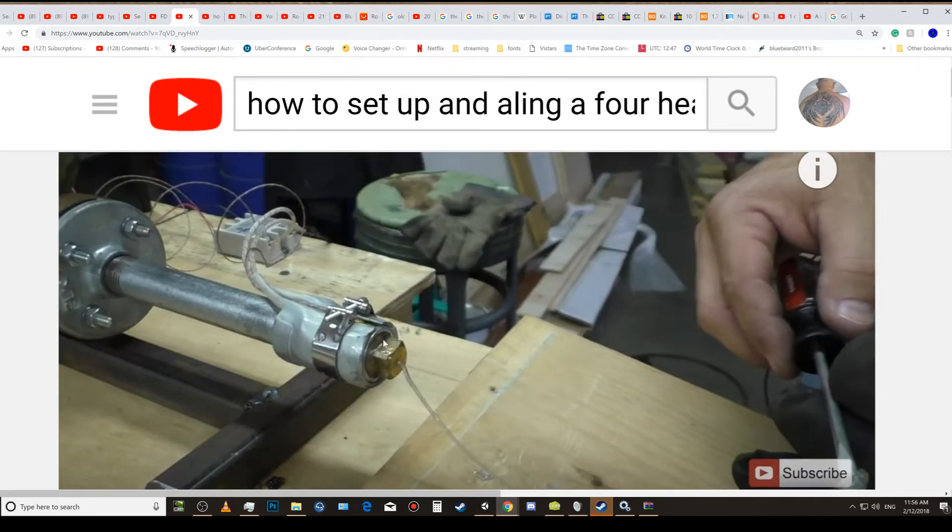Notice how the plastic is drooping — the reason it's drooping is because he has got that sensor too close to the end. It needs to be further back so the filament gets that tiny bit of time to cool down. Move the sensor back and you'll need to run a few tests. Also, you need to create a hopper dryer that blows the plastic around — it needs to be moving, creating a cyclone effect.